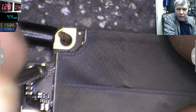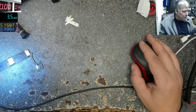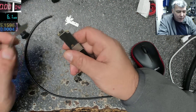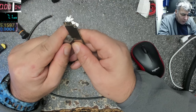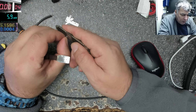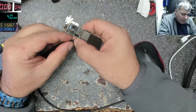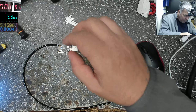What? It's not shorted! That's crazy - still taking power. Okay, I tested it. That's the reason why I started the video - because there was no short. That's sick. Let's open and see. It's not a short case. Something is taking too much power, and somehow it must be related with the screen, because it happened when they replaced the screen. I was so wrong - I probably connected the ground in the wrong place when I tested before starting the video. That's crazy.